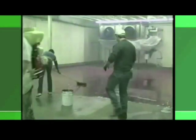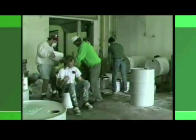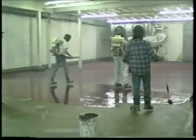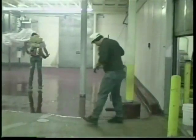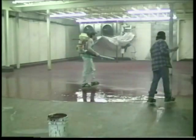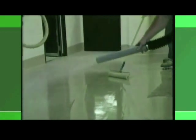Here is the rehabilitation of a freezer floor at a meatpacking plant near Omaha, Nebraska. A colored quartz sand was broadcast with backpack blowers into an overlay of self-leveling, fast-cure acrylics, including the vertical bumper curb. A walk in the park, wouldn't you agree? Here is a small laboratory project in the Kansas City area. The blower is oh so handy on small projects. A level surface means everything on this type of application, and the blower provides a nice, even distribution of the broadcast material.